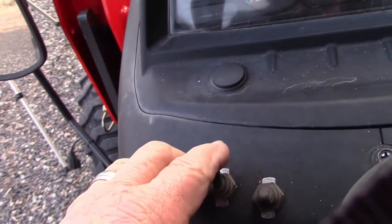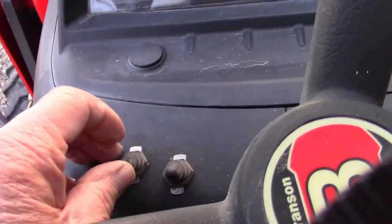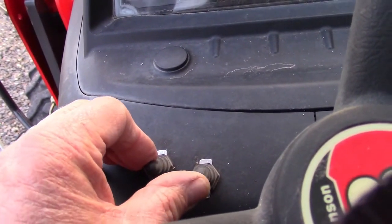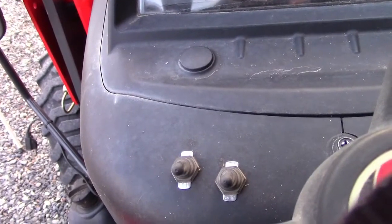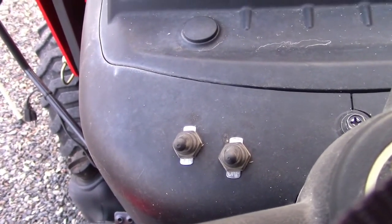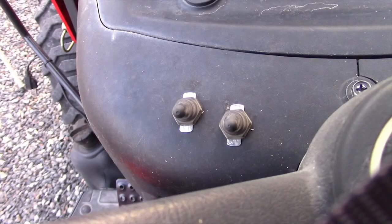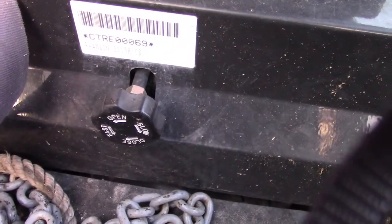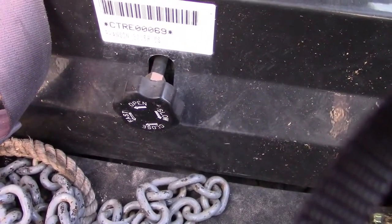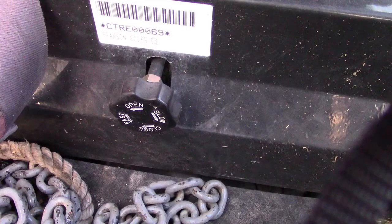In the event you're getting close to the highway or running a little bit on the highway, it's not a bad idea to switch the flashers on — that's the left-hand switch on the dash. The right-hand switch will turn on big flood lights mounted on the canopy, which will light up everything at night real well. This little knob directly below the seat is the hydraulic flow control for the three-point hitch, which controls the downward movement — you can make it drop fast or slow it down.